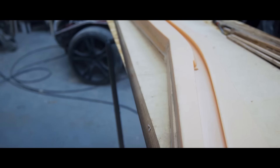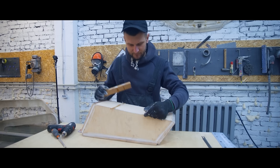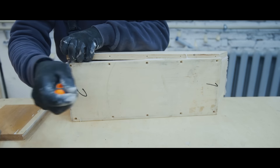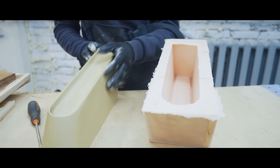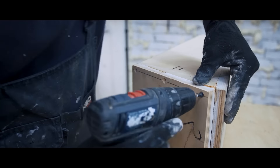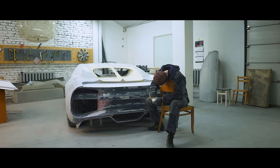Initially we planned to pour molded plastic there, then dye it and create the piece this way. But later our plans changed. Though we still planned to make the main light this way — the technology is the same but the shape is simpler. We're gonna change that. At this point we have a mold of the external part of the light, but of course the case has to be hollow. That's why we assemble the formwork again, put the piece there, and finish the inner counterpart, which should fit in the silicone mold. But it's not that simple either.